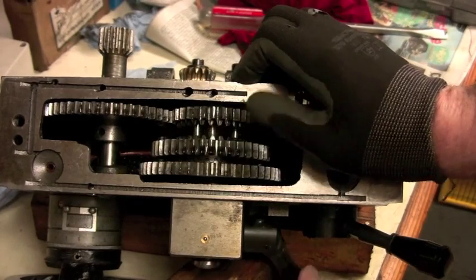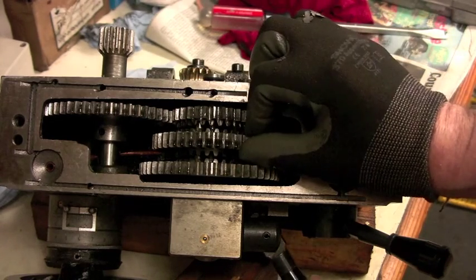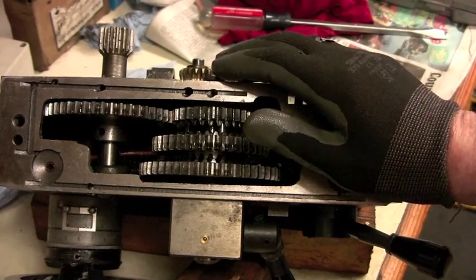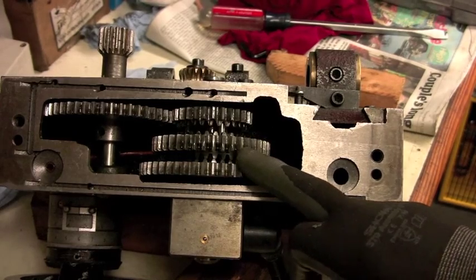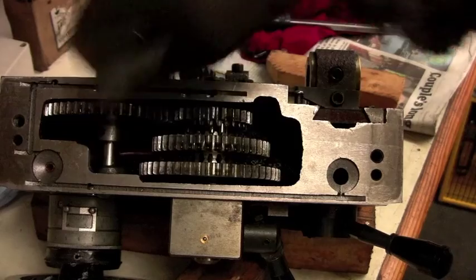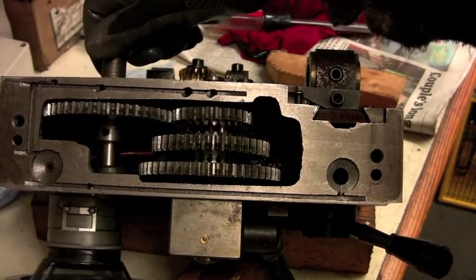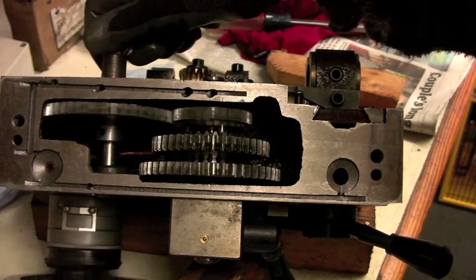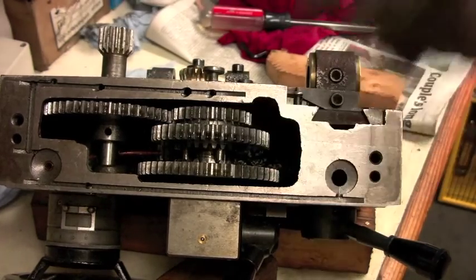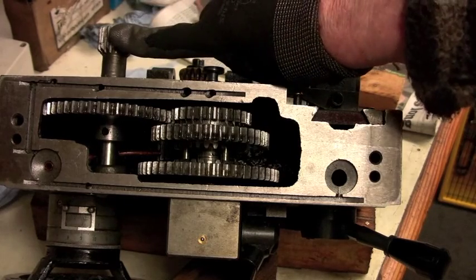The clutch gear is, as you can see, a dog clutch. This is the only one that can actually move backwards or forwards, depending on where you want to send power. They are all pinned to their respective shafts by means of spring pins. There are two more smaller gears inside which connect everything together. When the carriage jams, this gear will keep rotating - you've got power from the feed rod onto the carriage and it will keep turning no matter what. And that is the gear that gets bent.